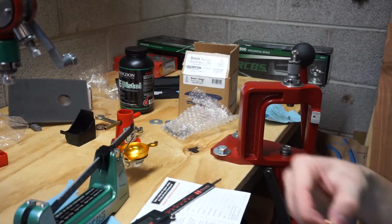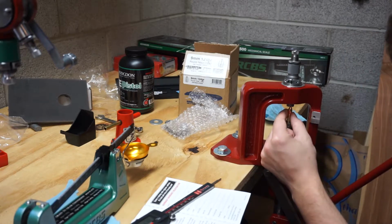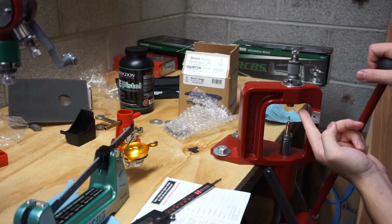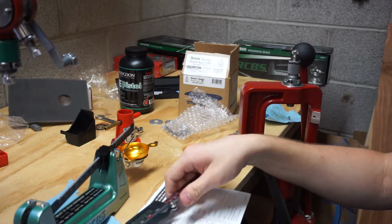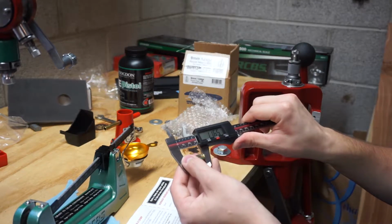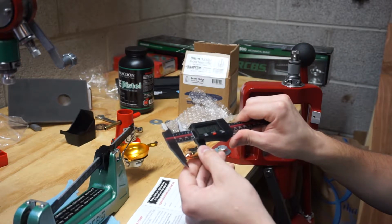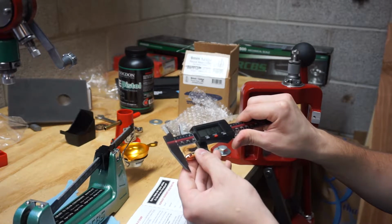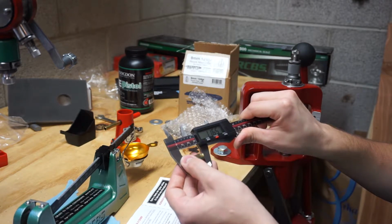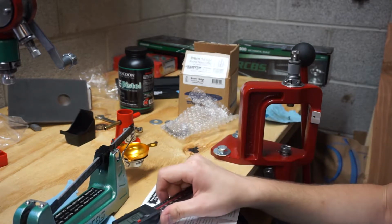And there's another bullet. I'm just guiding it up into here. I kind of like this floating collar design. Maybe I'll show that to you up close later. Okay, we're at 1.166. Somewhere in there. 1.165, 1.166. Okay, that's where we want to be.